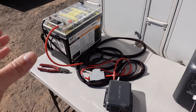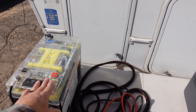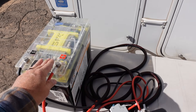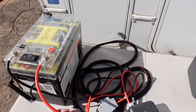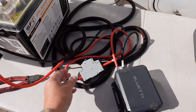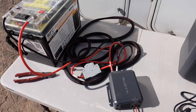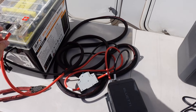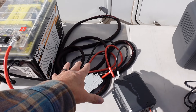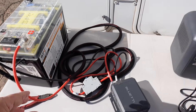So I have the battery hooked up here. If you were doing this, you'd want to make sure to fuse that if you're going to leave it somewhere where there could be a problem with the wire shorting or anything. The kit came with a breaker, but as outlined in my review it's very far away through a lot of wire, so there's a chance that things could be shorted. Just wanted to point that out from a safety perspective.